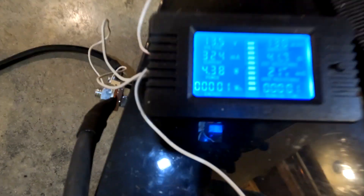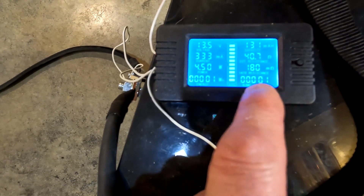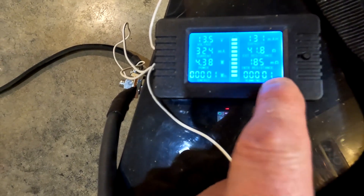Let's go ahead and look at our shunt to make sure it's working right. It shows that we've already used 130 milliamp hours and there is a running time of one minute. The test has begun. The time right now is 8:30 PM on Friday. I'm guessing this test won't end until Sunday morning — the first test got about 31 and a half hours, so that would put it around 3 AM on Sunday. I really hope I'm able to get at least two to three more hours with the freezer already frozen and a third of the way full.